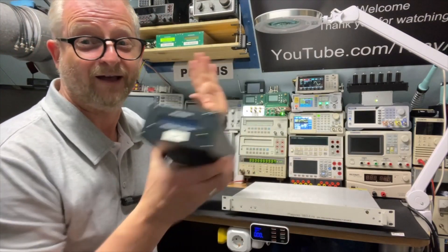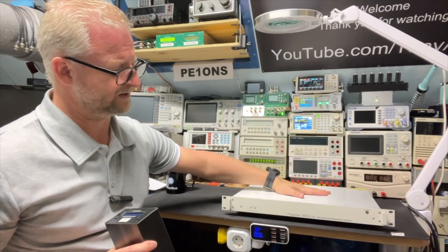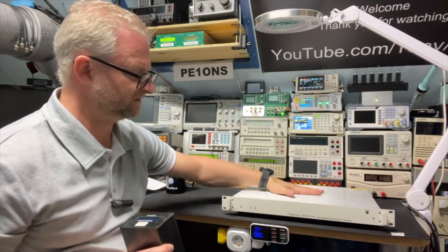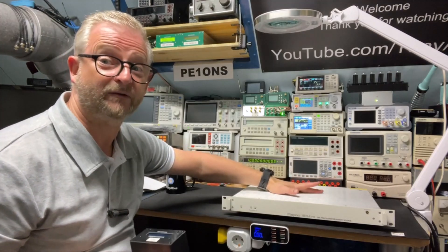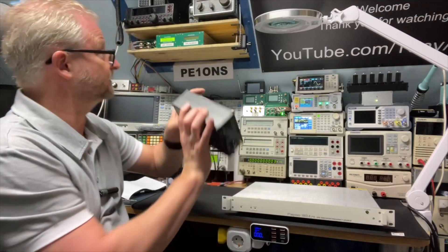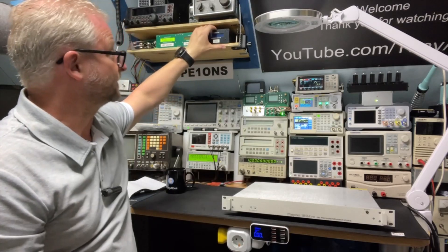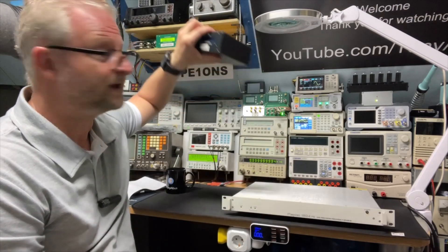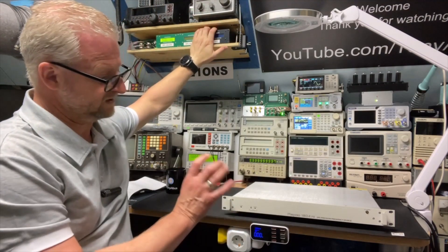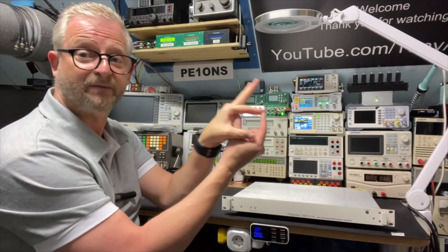We're going to open it. It's a professional one, and also a little bit older. It does have a Trimble receiver. It could be six or eight channels — in the M and L versions there were six-channel GPSes, which should be enough to monitor satellites. But it needs a really good view of the sky. These new ones are 12 channels, so there's a bigger chance they'll get a lock.